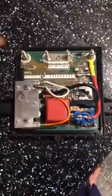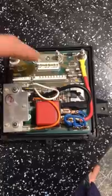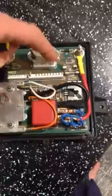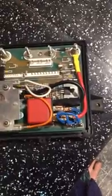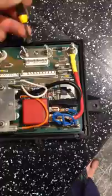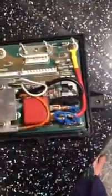So what I did is take a picture of it first so you know exactly where the wires go — that's obviously really important. These ones are more obvious: the orange one goes here, the purple-based wires go here, nothing on these ones. Take this off very carefully not to pull the wires off. You normally use a flat-headed screwdriver to lift it slightly and pull it off with your fingers, then undo the two screws.